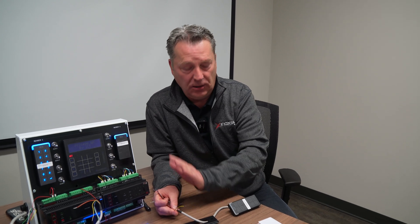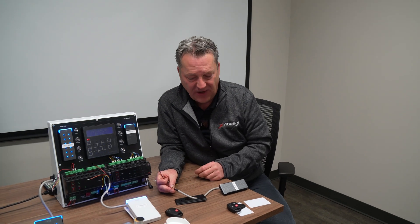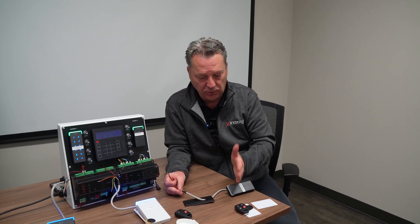They definitely suggest that everybody doing a new system go towards OSDP readers and OSDP communication protocol, unless reusing old wire wired using Wiegand D0/D1 wiring. That way, you can have end-to-end encryption from your card — using Desfire, Desfire EV1, or EV2 cards — to the reader. It is encrypted between the card and the reader, and between the reader and the controller with OSDP slash ICT-485, there is encryption and supervision.